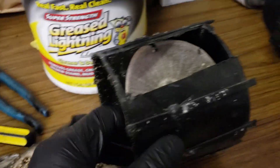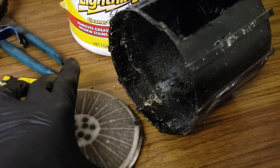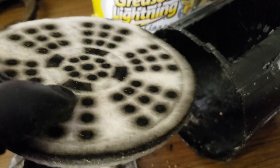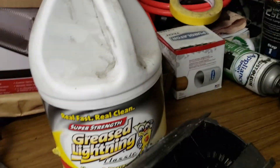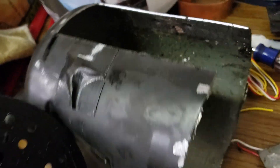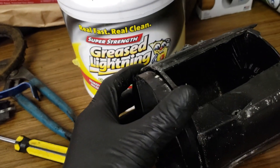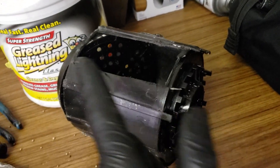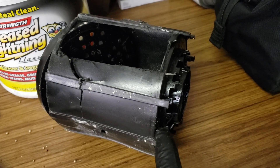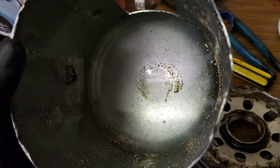So last clip here. Now that I got it out, this is the cartridge that goes in. What they've done here is they've got a couple of layers of this padding material — this is mainly just to kind of keep the beads from coming out. You can see there's some oil leftover residue. Now this here goes to the bottom of the can — the non-thread part's the bottom. It's got a spring here, and what this is doing is it's pushing up against the beads, keeping them squeezed so that when it does retain moisture it keeps them nice and tight. So air comes in here, goes through, comes out the outside of the canister and goes back out — that's why they have these little spacers on the side. This whole thing just slides into one unit inside the can. There's not really anything else in the can — some remnants of oil.